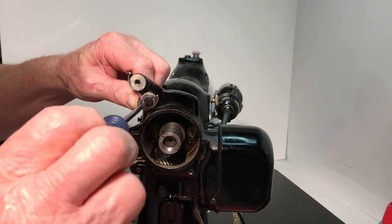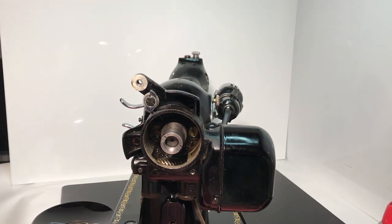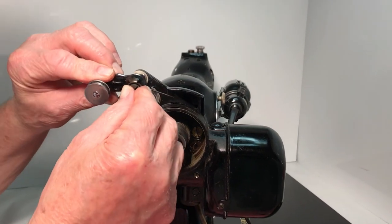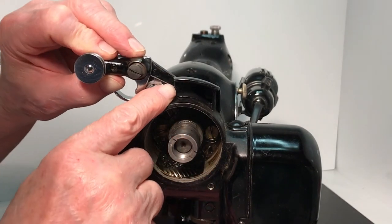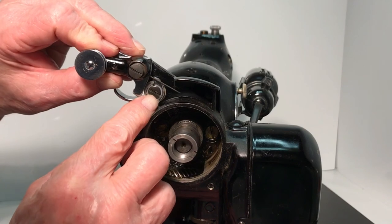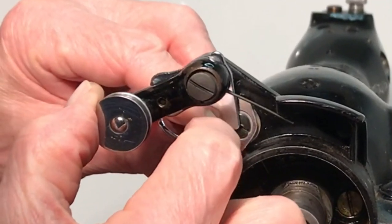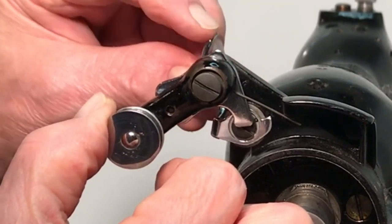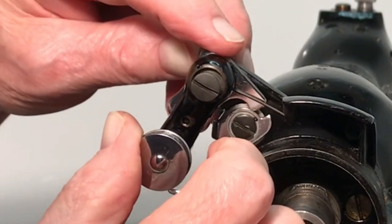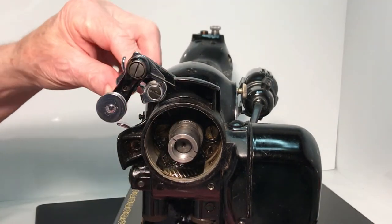With the screw tight, the latch should move freely. Take the frame and insert the frame screw. Start the screw in the hole, but just a little turn to make sure the screw won't come out. Pay attention to the frame spring — it has to go under the balance wheel. I'm slowing this clip down to show how the tripping arm attached to the frame has to clear the stop latch. That's why you leave the frame screw loose, to give room to clear. There you go. Tighten the frame screw. Everything is working freely and correctly.